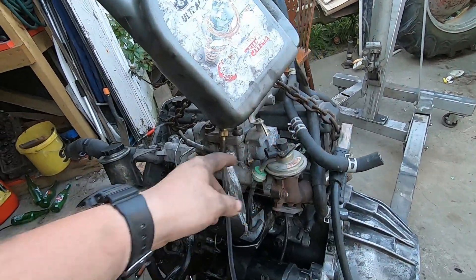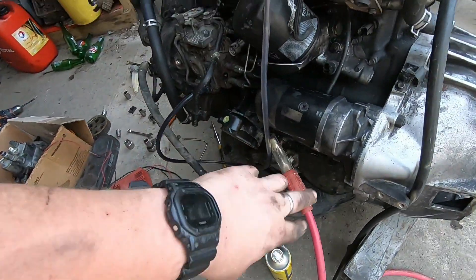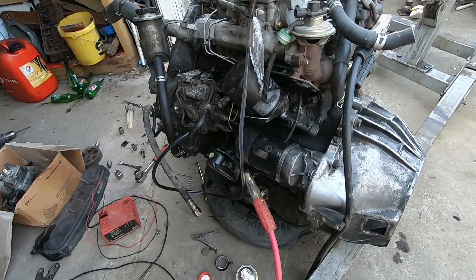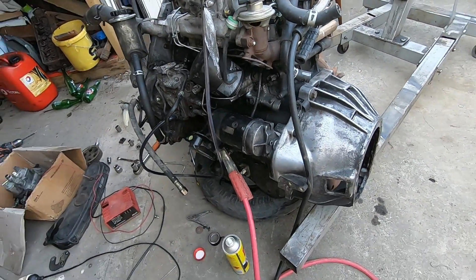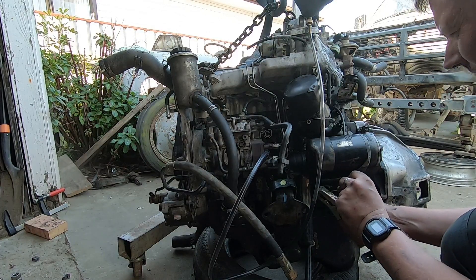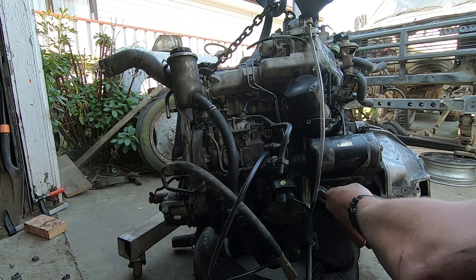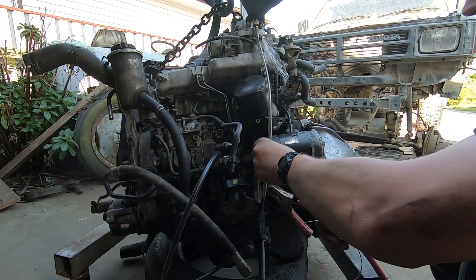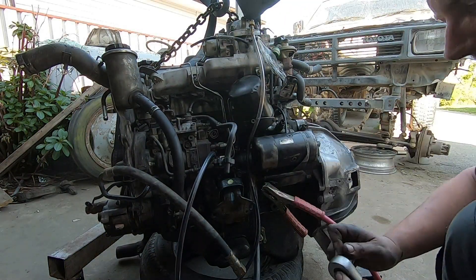I've got a makeshift fuel can — it's just an oil can with a fitting in the bottom going to this hose — with some diesel in there ready to go. Got the starter motor on there, a battery with some jumper cables to try and make the starter motor crank over, and the battery charger hooked up to the injector pump to open the fuel solenoid. When I bought this motor the guy did say the starter motor was a bit iffy and starting to get a bit slow to crank over. Let's hope it cranks. The starter motor solenoid is definitely throwing out — you can hear it clicking — but it doesn't seem to engage the motor to start cranking. I might grab a hammer and give it a little tap.